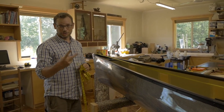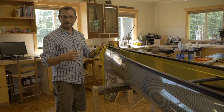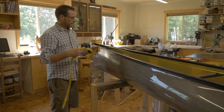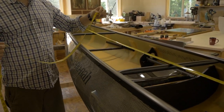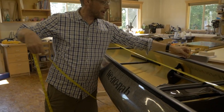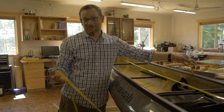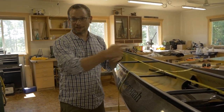This is where it's really useful to have two other people — one to help handle the tape across a wide boat in the middle, and a third person to write the measurements down so you don't have to put the tape down every time. Even if you do it all yourself, I can do a boat in maybe 10 or 12 minutes. If it's your first time it might take you 20, but it's still not bad. At the middle of the boat, if I want to take the 9-foot measurement I would actually flop the tape over the boat, hold one end, and reach under to get the other side. That gives me a reading of 49 inches, and the full circumference is 71. If I had to write the numbers down alone, I would roll the tape over the boat so I didn't have to crawl under it again.